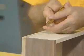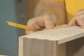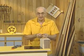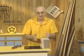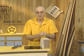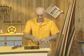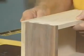Well, when it's closed up, it really doesn't take much to do it. It's pretty thin, as you can see. However, I'm going to use a 1/4-inch bit and cut a slot in the back of this box. That's going to be the length of the hinge, and then that'll give us this 1/4-inch. It sounds like a lot of space, but what we have to do is allow for the kerf of the cut around the box, so when it closes up, we'll lose half of that. And that should be just exactly what we need. That's a big job to chisel out a piano hinge that length in a narrow piece. If you had this up here and tried to mark that and chisel it in, it would take quite an operation, where the router is very simple.